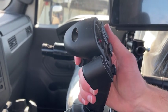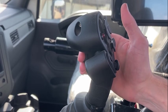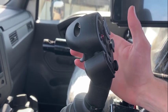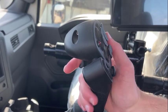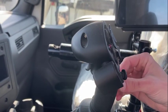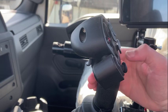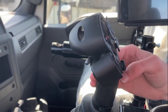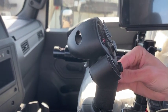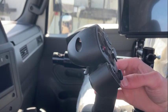However, in freestyle configurations, the unit can be reconfigured to make the trigger non-essential. In which case, simply pushing the joystick forward past the zero point will engage whatever settings you have. So if you have your conveyor at zero and you push the stick forward to 10%, the conveyor will not run. However, the beaters will engage and the floor will run at 10%.